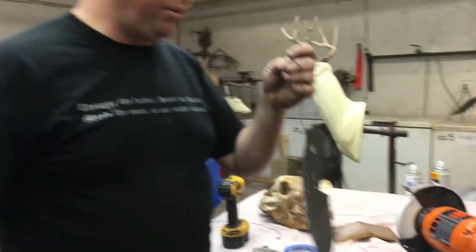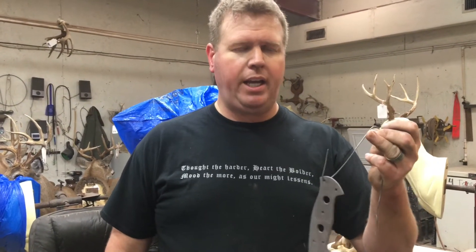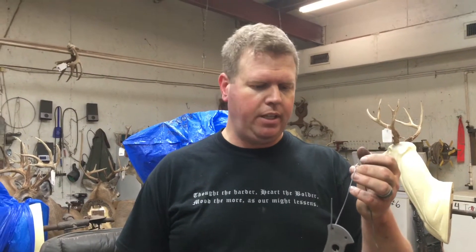And that's all there is to it. I'm going to try to heat treat these tonight and show you what they look like when they come out. They look great when they come out. I have not had any scaling problems. I've run this stuff up to 2,100 degrees on some S110V. It comes out great every time.